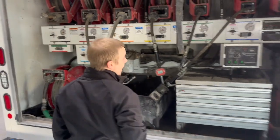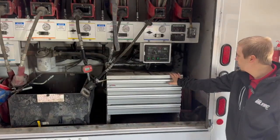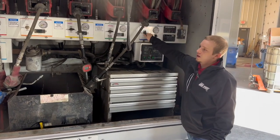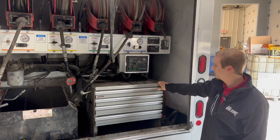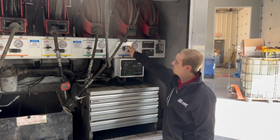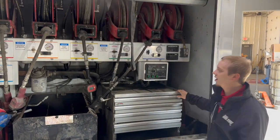Once all your fresh oil tanks are full, you would just turn your compressor on and put pressure behind it. We regulate this at 80 PSI — you're not going to really need anything more than that. It kind of just depends on preference, but it does not hurt anything if you keep this open to create pressure. You can have them all on creating pressure at the same time.